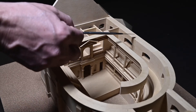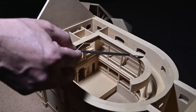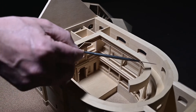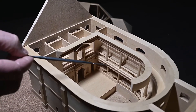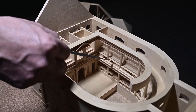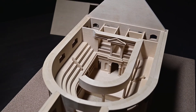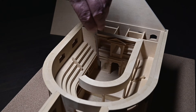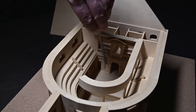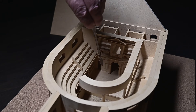This section here is a straight piece cut into mitres and then sanded around. The columns were all turned on the lathe. The balusters were all cut to length, chopped off, and glued together. The rear wall of the stage — you can see the alcoves — were constructed the same way as the exterior walls: cut horizontally, the rear of the alcoves sanded round, the arch made, and then all glued back together.